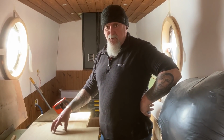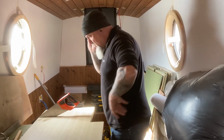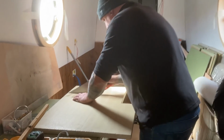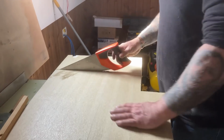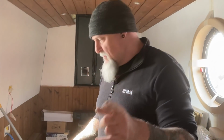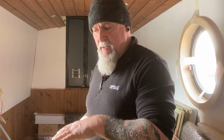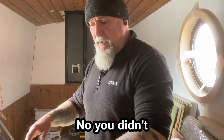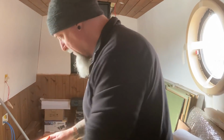So it's an industrial adhesive to glue those on. Then we'll just grout them anyway, like we would normally. But we're just cutting these down a little bit because we've decided to make them a bit shorter. So I've just taken the top off. Top off. For you Pipkins fans. I'm also going to tile these flat on the deck and try and mount these in a way that if I ever need to, I can get them off. So if I was to screw here then tile, then I'd have to break the tiles to get this board off. Can't see why I'd ever want to go in there, but you just never know.